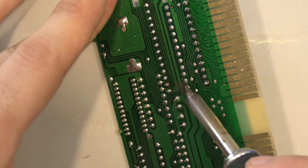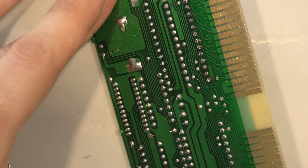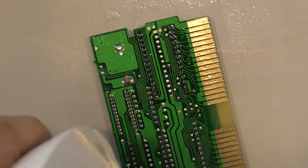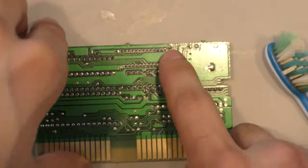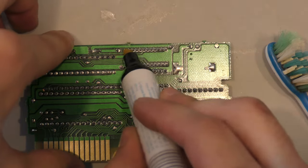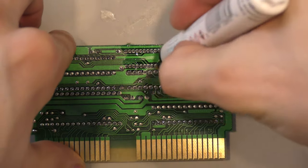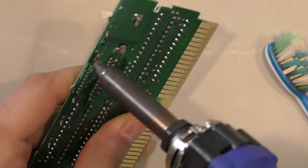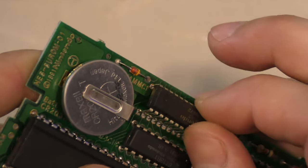So after swapping the work RAM and the character RAM, this still locks up during the battles. So there's only one chip left that I can swap, and that is the MMC chip. On this game, the MMC chip is an MMC-1B3, but on the cart profile website, it lists an MMC-1B2.